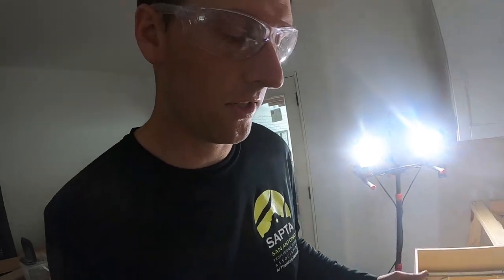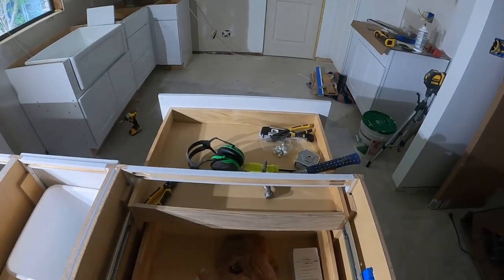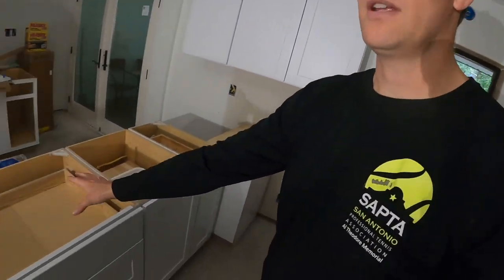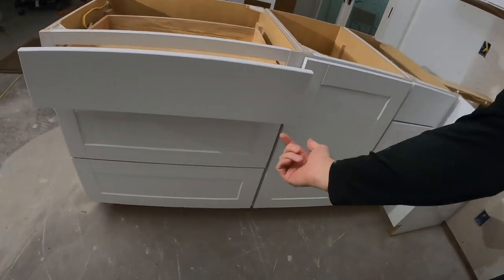Pretty simple job really. I used a few more tools than I thought I would initially — a screwdriver, some wire cutters, a level, and a hammer for the wire staples — but pretty basic tools that anybody should have, and if not, they're cheap to buy. I'm not going to show you how to wire up the outlets in this video; that's a pretty simple task and you can search YouTube for hundreds of videos on wiring an outlet. My purpose here was just to show you how to run the wires and get them into the boxes in your cabinets. One question I know I'm going to get: some of you may be trying to do this when your countertops are already in place. Mine was easy because I don't have countertops, but it's honestly still pretty easy — you would just take out your drawers and do it from inside. The biggest issue of course is making sure you have your electrical coming from the wall.